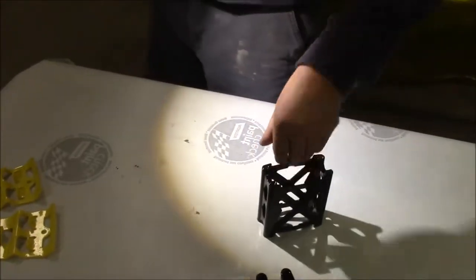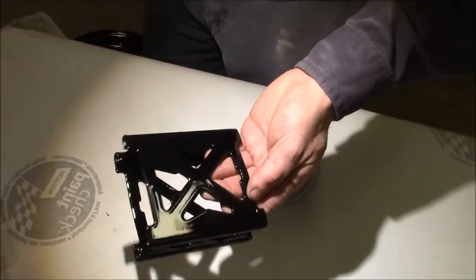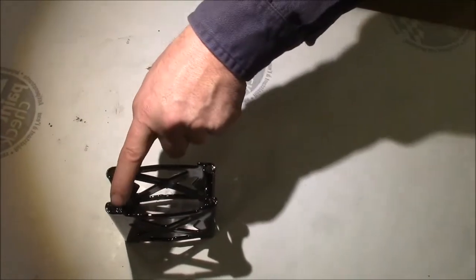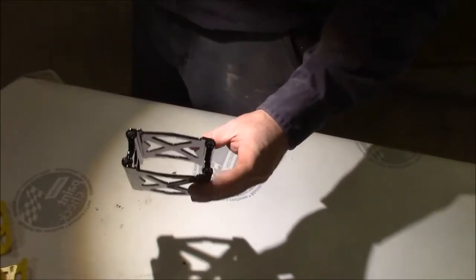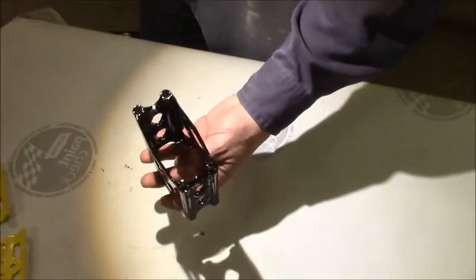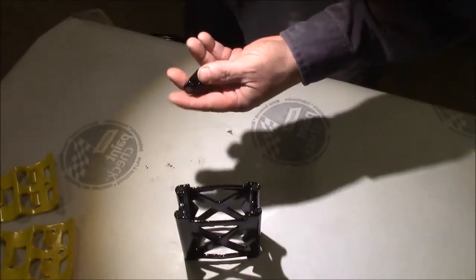We also have the steering component — I think they call it a riser bracket — in normal gloss black. I've already got some dust and fingerprints on it. Something really important we showed in the first part of the video: the silicone grommets protected these thread holes during baking, and once removed, the threads are completely unaffected and perfect for the customer to reassemble.